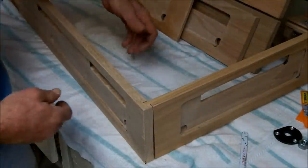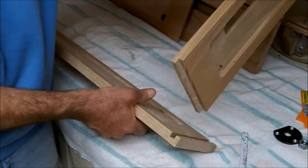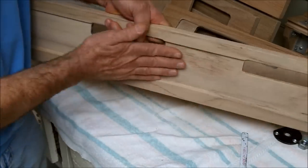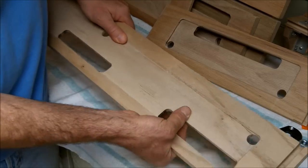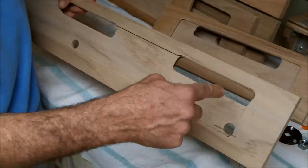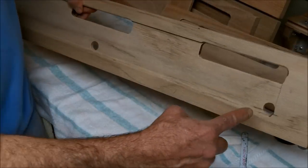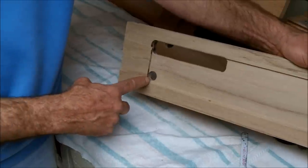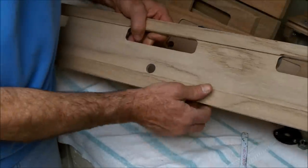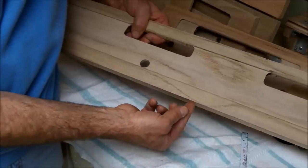In designing the rails, I decided to spend a little extra time making a fairly strong joint that glues quite well. On the rails themselves, to decrease the weight, I made a routed recess on each half so that the width in the middle is 3/8 of an inch — half of the 3/4-inch oak. I added handles by drilling 1-inch holes and using the router to trim out three hand holes. I then put rope guides at the corners as well, just for fun. I put the lower edge at an angle so that rain wouldn't catch, and I made this so that a 1-3/4-inch screw can mount from the base through and fit quite well.